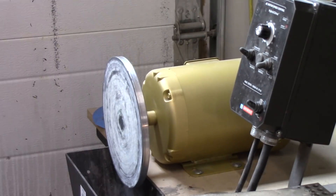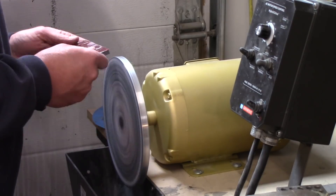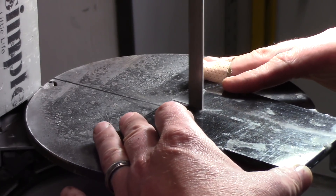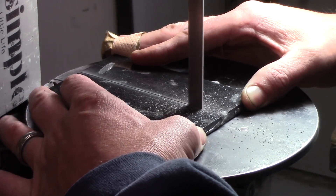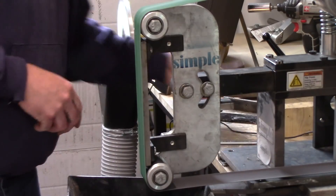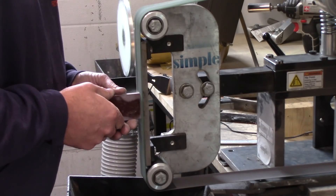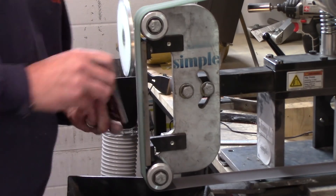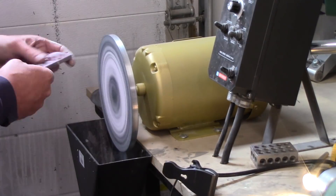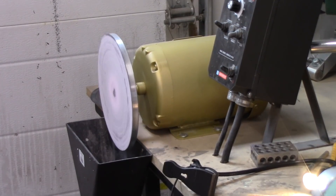Post glue-up, I epoxied the two pieces together and flattened them out. I had some big hanging globs of epoxy to get rid of before making a decent cut. Rather than gluing up two separate sets of handle scales, I just glued this whole piece together and cut it in half — that works well. I get a lot of questions about what I clean the belts with — those are called a rubber cleaning stick, an abrasive rubber stick. They just clean out the little valleys of your abrasives so they cut faster for longer.